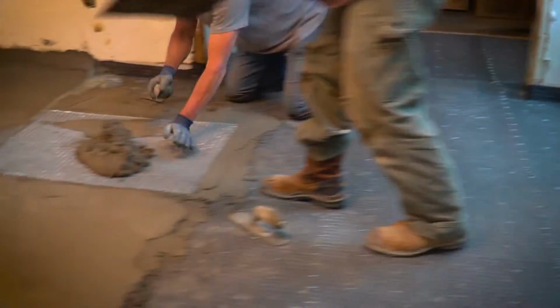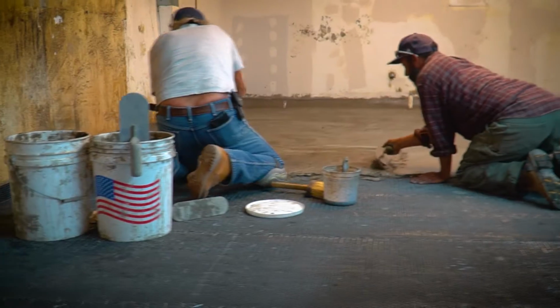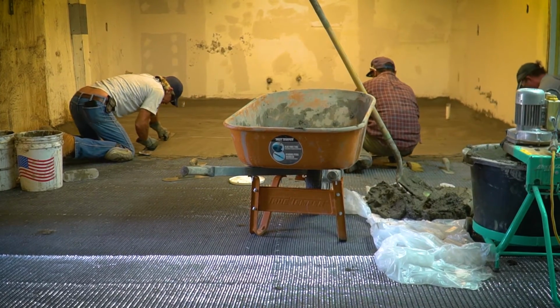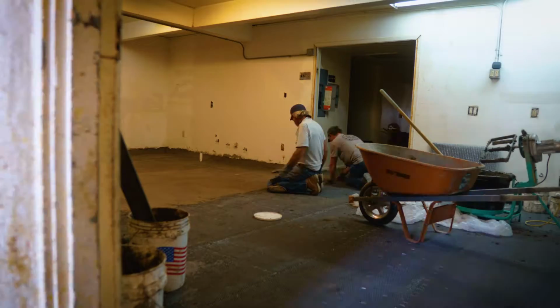And then we float it with a strong acrylic mix, acrylic vinyl acetate copolymer, or they call it Acryl 60. And then we smooth it out, so that makes like a waterproof seal that will hopefully last forever. So a maintenance-free roof and a pretty tough shell. Still working out the kinks after 20 years, but it's getting better and better all the time.